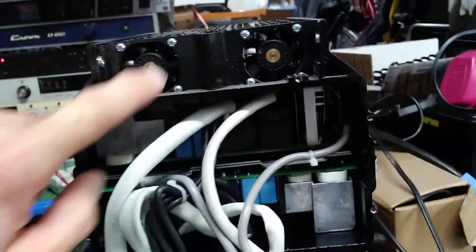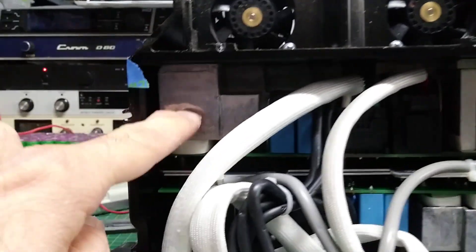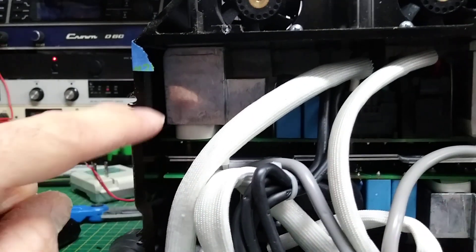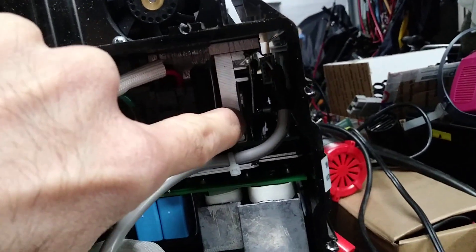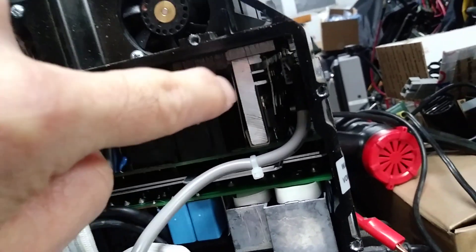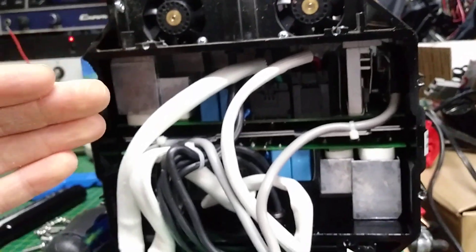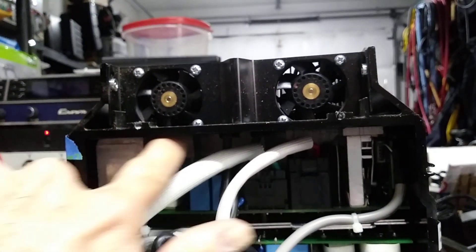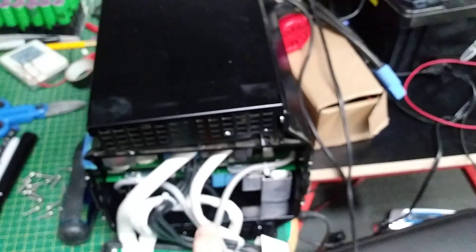The way to extract heat from inside to outside is very well made. You have all those big aluminum blocks - those are inductors - and I think they are covered by an aluminum cap for EMI shielding, to avoid interference with surrounding devices. There's a bus bar with some TO-220 diodes, and further you see TO-247 big MOSFETs for the switching power supply, since this is an AC to DC converter. All that heat is communicated to the top plate, there's a heatsink bolted on with fans, and normally there's a cover on top.